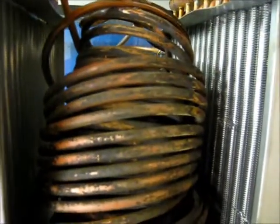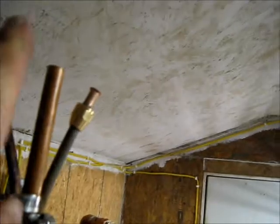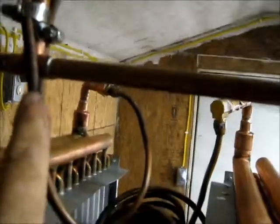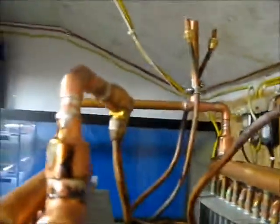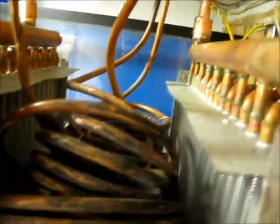I've got that stack of copper coil right there. There's actually an interior coil — you can see it there. I've got a four-inch coil on the interior and a six-inch coil on the exterior, and I've got one of those on each side. They're plumbed up so that the center pipe is the incoming water. It comes down and tees into both radiators, and then exits out the other end of the radiators and goes to the center coil in each stack, then back up the six-inch outer coil.